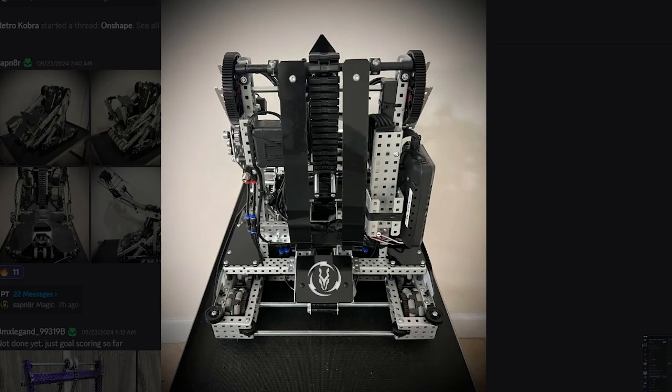Excellent battery placement. This saves you so much work and agonizing pain when switching batteries — this will be meta. A lot of tournaments are all about just saving yourself time and not getting tired out towards the end. Once elimination hits you're going to be so tired and start making more mistakes. If you have to take the battery out, taking a minute to unscrew stuff — like what we did on our Worlds and U.S. Open bot — it took us an eternity. We had to literally unscrew our odometer wheels off and take off a metal C-channel holding the battery. At U.S. Open for the finals, everyone was already ready and we had to call a timeout because we had to switch batteries.